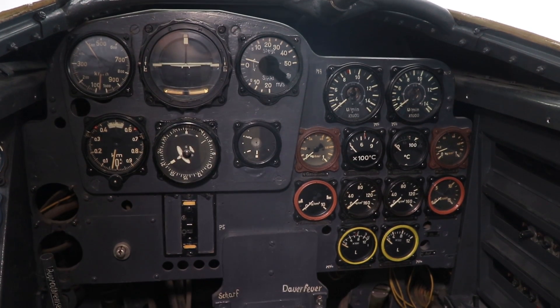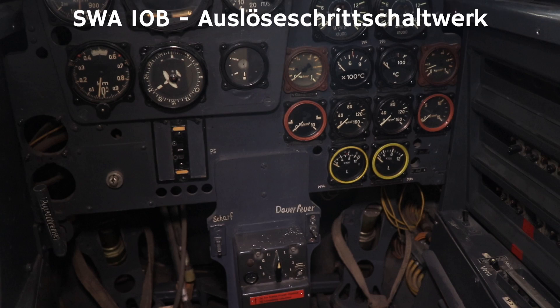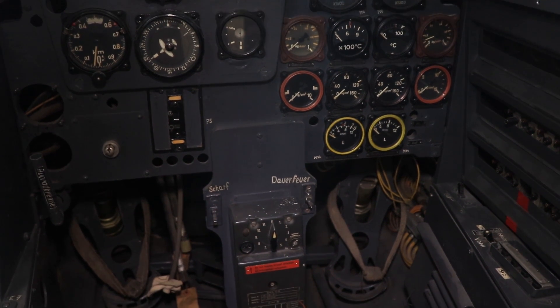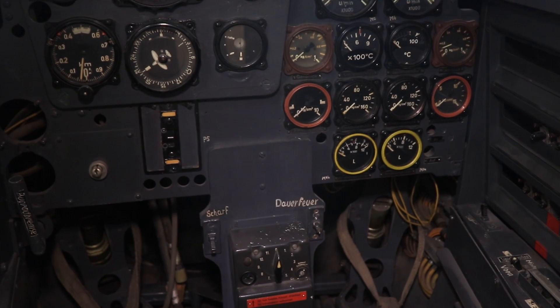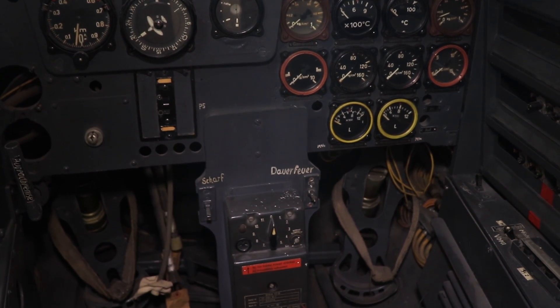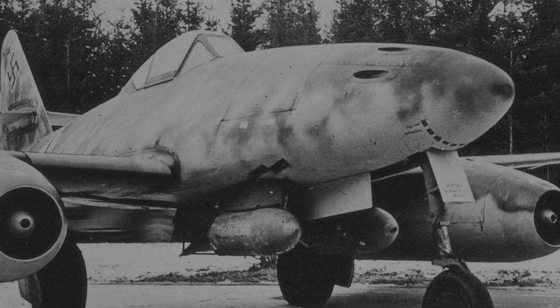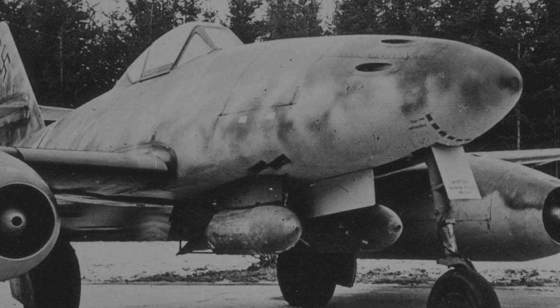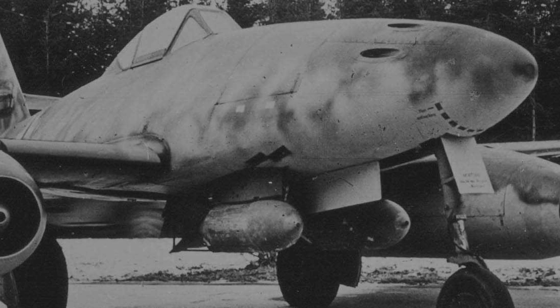Below all that we have the central pedestal with the SWA-10B, the Auslöse-Schrittschaltwerk — essentially with this the pilot would operate the R4M rocket system. The left flick switch arms the system, the right flick switch allows continuous fire instead of set salvos. The fighter-bomber version of the ME262 would also have a similar pedestal, a Zünderschaltkasten for the bombs in this position.